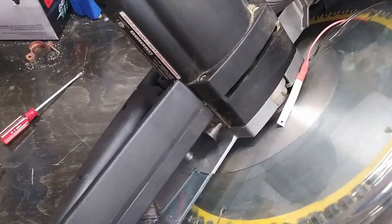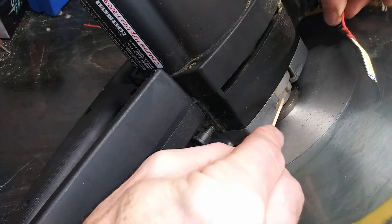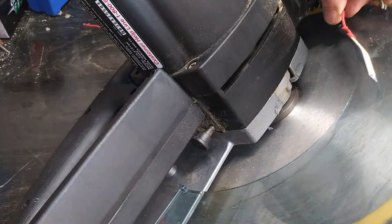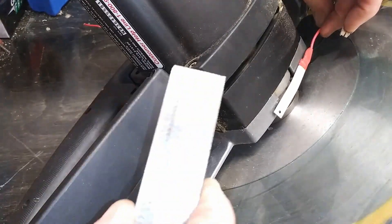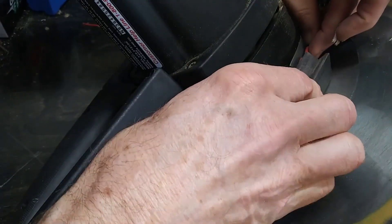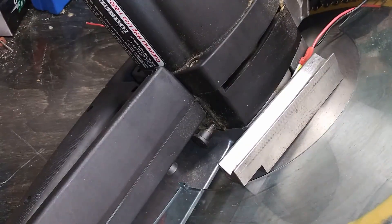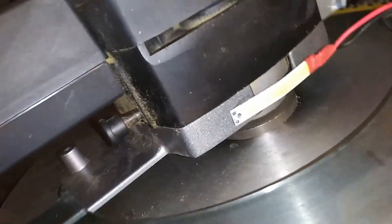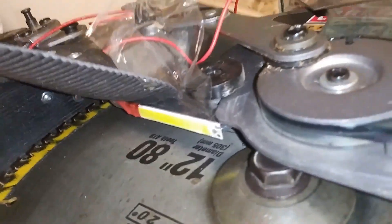I did put epoxy on the other end of the LEDs. Here you can see where I'm going to put the LED on one side of the blade — the bottom side of the motor mount has a place. We can put some epoxy on that metal and drip some onto the saw, and I used a piece of heavy metal to hold it in place while it cured. That turned out not to be my greatest idea. On the other side, I figured out I could use some clear packing tape for a much better way of positioning it. The first one worked but my positioning turned out a little bit crooked — the light is located so it's going to cast a shadow down the side of the blade. On the opposite side I just had a thin piece of casting, but it was enough to put epoxy on and use packing tape to hold it in place. That one I did get straight, so it's going to cast a shadow down the left side of the blade.